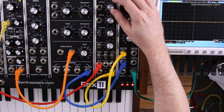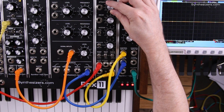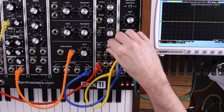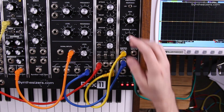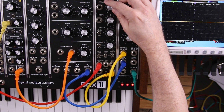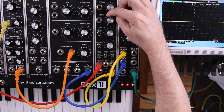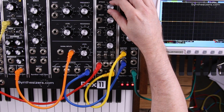Here's a common mistake when using a very fast envelope generator like the Q179. If you turn the knobs in fast mode all the way down to zero, you'll get clicking. That's because the envelope generator is doing exactly what it's supposed to — it's operating very fast and giving you a very fast rise time. So turn the attack knob up a little bit. On a Q179, 0 to 5 is only 100 milliseconds.